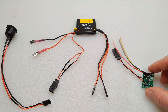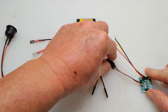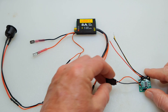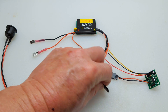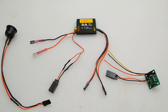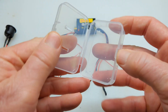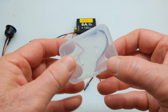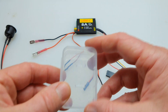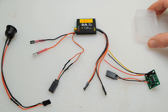Over here on the servo control board, I did the same thing for the power input. I took a female three-pin connector, just used the positive and the negative, and then one of the outputs from the BEC is going to plug into that. I'm going to put each of the servo control boards in one of these little plastic cases — you'll recognize this case if you've done any work with wireless receivers. I cut a couple little slots in here for the wiring to come out, and I'll use some double-stick tape on the back to hold it in the box.